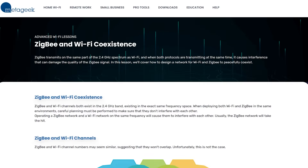For some people, replacing the USB coordinator will probably be enough to make their network more stable. But if you're like me, you probably didn't plan your Zigbee network in any great detail, and just started pairing devices willy-nilly as you bought them, moved them around your house, and didn't factor anything like router placement and 2.4GHz Wi-Fi interference into your plan. The second improvement I made was to ensure that my Wi-Fi network was on a different set of channels to my Zigbee network to prevent radio interference.